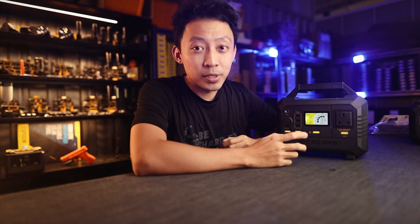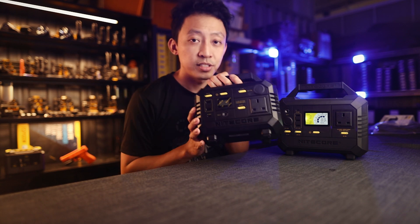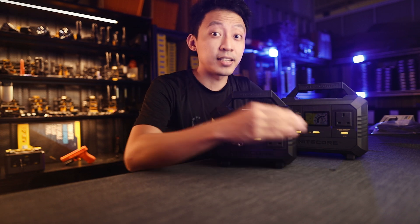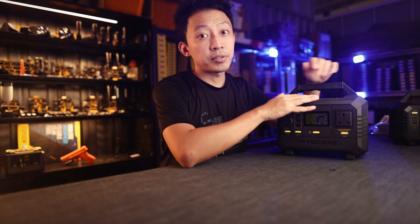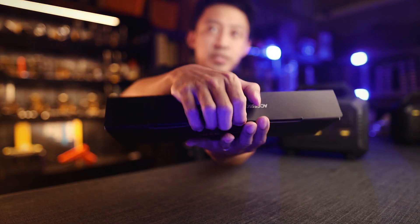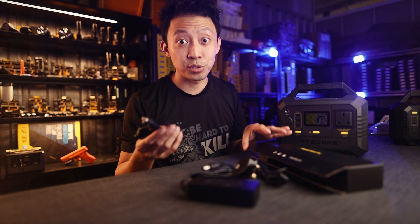Another example: one client wanted to power his mini fridge in his SUV so he always has ice cold beer ready for road trips. Most mini fridges draw about 70 watts. On the NES 300, 300 divided by 70 watts gives you 4.2 hours. But mini fridges stop drawing power once they reach the desired temperature, so if you don't open it often it can run much longer. On the NES 500, it runs for 7 hours — more than enough for a weekend trip, camping, or fishing. You can also charge the station with the included car charger, meaning the unit can live in your truck, van, or SUV.